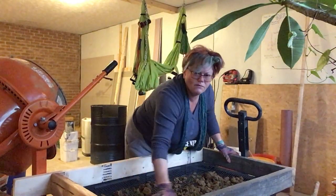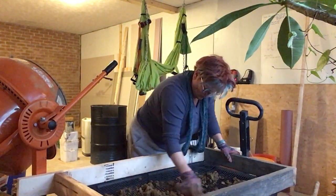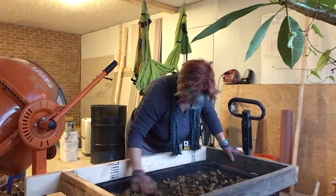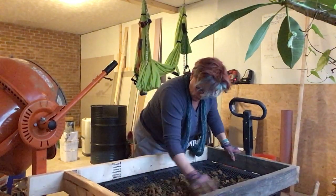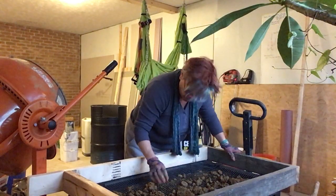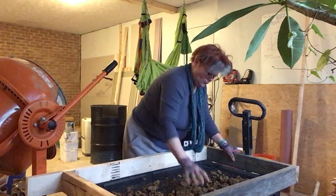So if you get it to stay in place, you can get 2-inch wool and compress it and make a great seal where you put the cap on the edges, but through the middle it'll stay 2 inches thick, and that's probably the best insulation you can get, in my opinion. So, yeah, there's that.